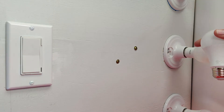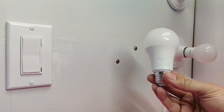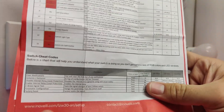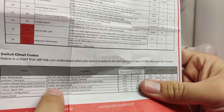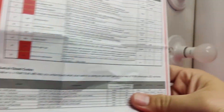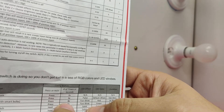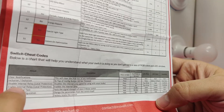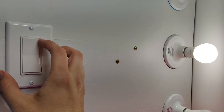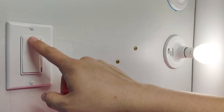When you put a smart light bulb into the socket, turning the switch off will kill power to the bulb and the bulb will be useless. The manual that comes with this switch shows you how to change settings using the config button. One of these settings is the option to disable the internal relay, which makes it so that pressing on or off does not change the power state of the bulb. To disable the relay, press the config button eight times quickly in succession — make sure the bulb is on when you do this, otherwise it will be stuck off. Now when you try turning the switch off, you don't hear any click and the bulb stays on.